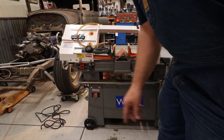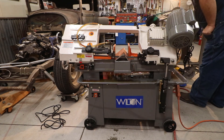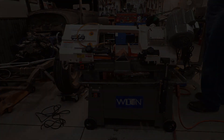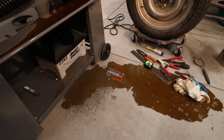On the first go I ended up having to do an emergency shutdown. I walked around the back of the bandsaw and saw that there was fluid everywhere. Evidently my initial epoxy joint with those plastic fittings had failed. I don't know if it was a pressure problem or if the epoxy was a bad match for the plastics involved, but that created a big mess.